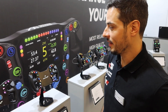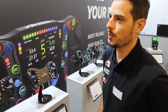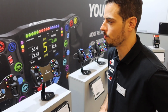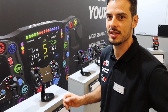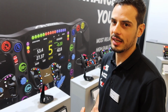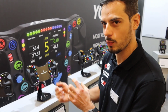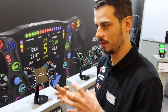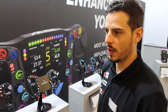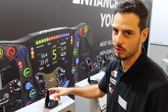Yeah. And another point to finish off the illumination buttons, we didn't want to have a very bright LED spot in the middle. So we tried everything for many months, how to get it right that the illumination is consistent. And we can only do this with completely customized parts. So we have a piggyback PCB for the LED, which is sitting underneath the cap. We have a 2-component cap, and everything is very tight inside. But only this way we have the very bright illumination, but also very consistent to the edge of the button cap.